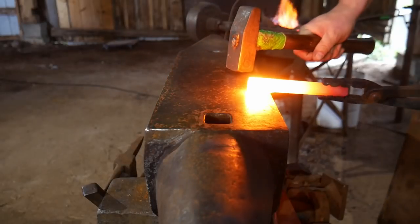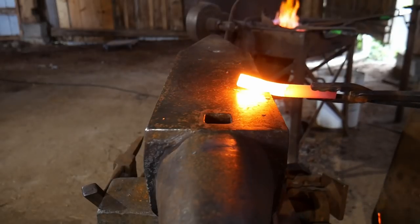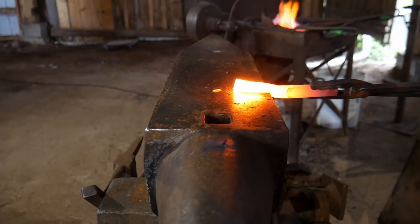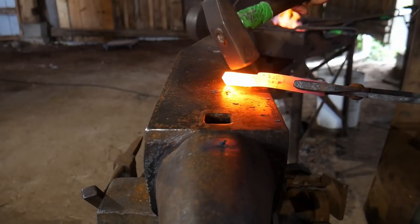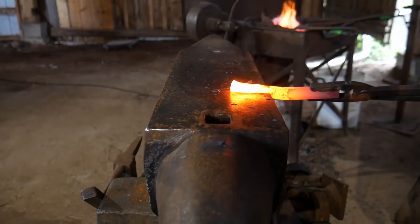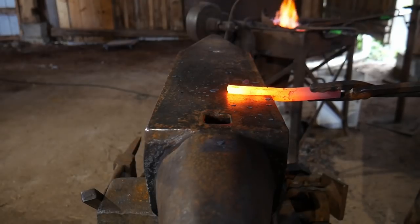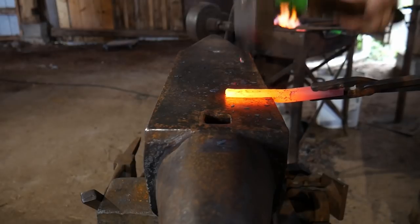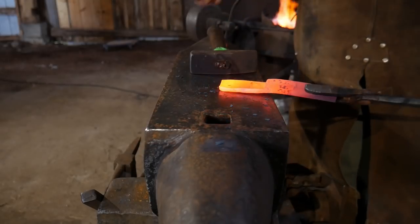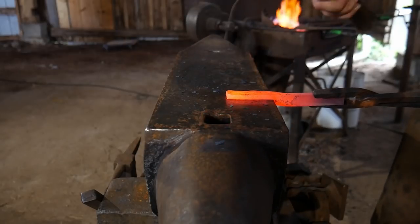We're going to put the three-quarter side up, lay about two inches of material on, and hammer half on, half off blows, straight down. We do not want to correct the spreading of the width. We're going to take that down to roughly quarter inch thick or six millimeters thick, and we're going to leave it there.